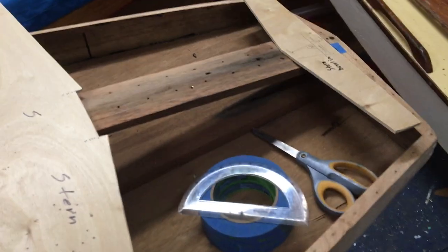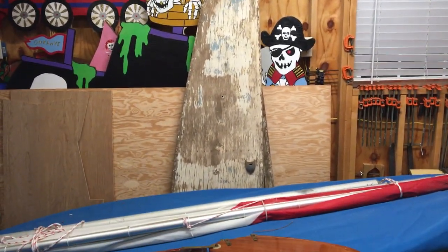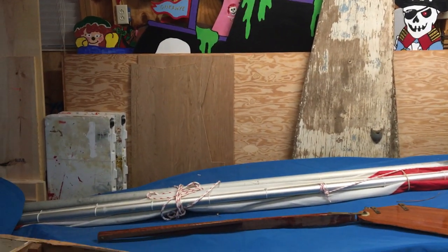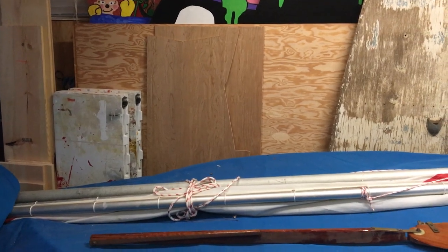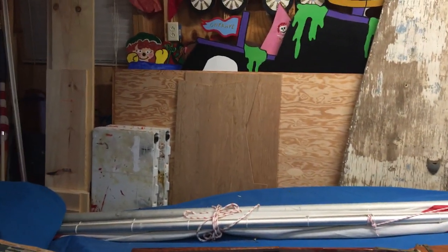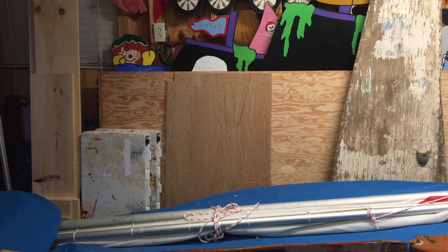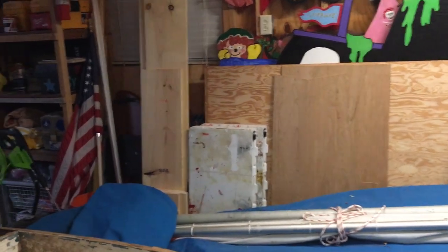We've got the old bottom pieces over there ready to go with the plywood behind it — we'll lay them down and trace them out, just a little bit big so we can put them back on the boat and fit them. We're using two-by-four sheets of plywood to trace these frames onto because we find a real nice edge along one end and then a square corner. So we've got four pieces — we can do two frames per piece with nice square corners, so we're not having to cut those three edges with any type of saw.